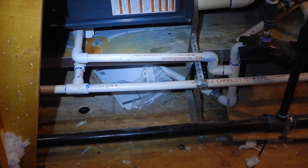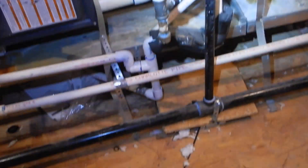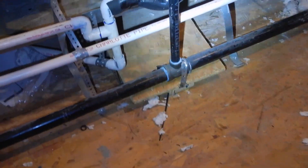I'm not happy about the condensate situation. I'm concerned about the rusty water and the fact that we do not have a condensate neutralizing filter. Over here is our primary drain — right in there. It's kind of tight, but that's your primary drain. It's insulated like it's supposed to be. But that's a shallow trap.